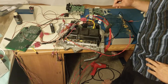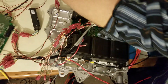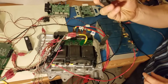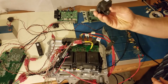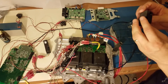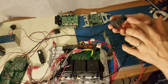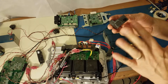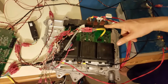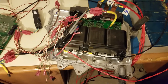The current sensors turned out to be kind of interesting. Here's a sample — this is a 2011-2012 Nissan LEAF current sensor, and this one was pretty standard. For the 2011 they had a 5-volt, ground, and a signal. For this newer version they had 5-volt, ground, and two separate signals, but the signals were the same, so it was probably for redundancy.